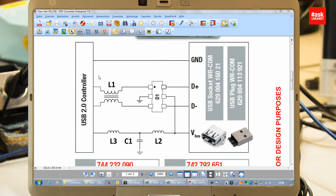Hello my dear friends of electronics. Today I want to introduce to you filtering for USB port. We will talk about the EMI situation on a USB port. For this reason I recommend to use for the data line at least a common mode choke. This common mode choke should be something like 90 ohm impedance.